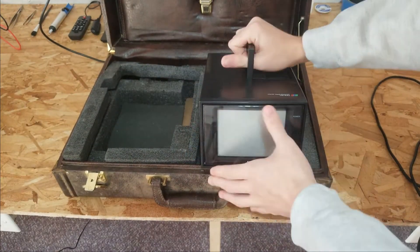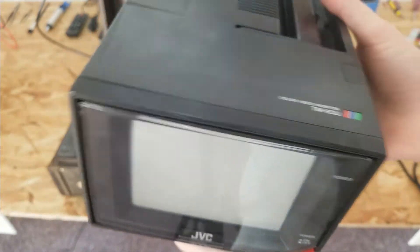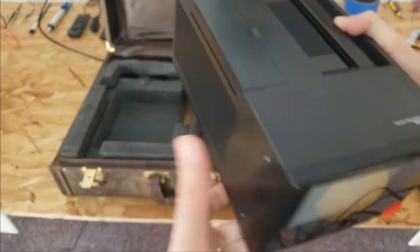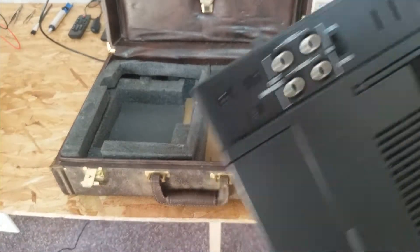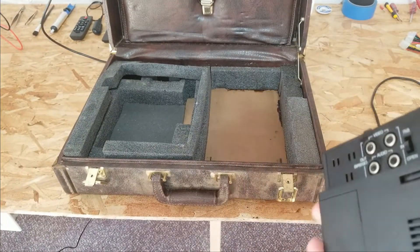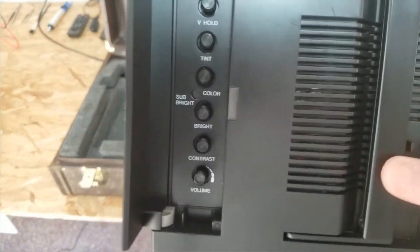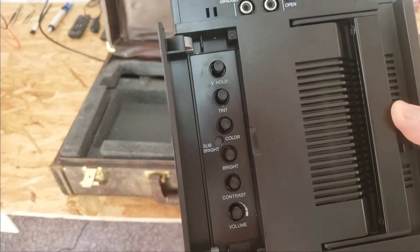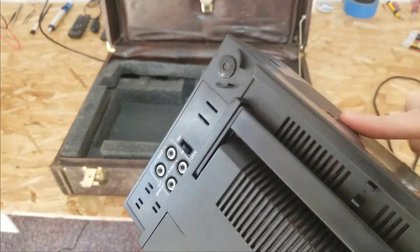Also in the case, you probably noticed this color monitor from JVC — the TM63U. It is really really tiny; that's my hand for size comparison. It has video and audio inputs, a 75-ohm termination, runs off 12 volts DC so it's portable. Underneath there are more complex controls: vertical hold, tint, color, sub-brightness, brightness, contrast, and volume — really nice controls.